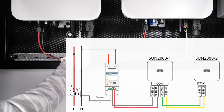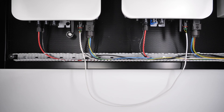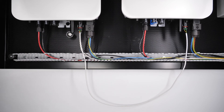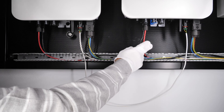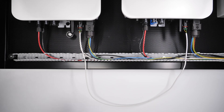In the communications port, pins one and two must carry the RS485 cable communicating with the different inverters in cascade, while pins three and four connect to the energy meter. On the secondary inverter we have also connected the positive and negative panel inputs in series and the RS485 communication with the master inverter, plus the AC power connections.